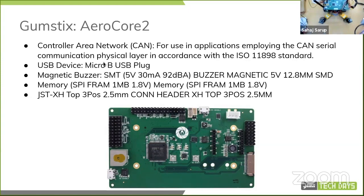Apart from that, the USB plug here says STM console. In its original firmware, which actually runs PX4, a very, very old version of PX4, that's why I decided to get Zephyr on it. But the console port is actually a USB port directly from the SoC, so you can use it as an external storage device or console. I actually have configured it as an external storage device, so you can have your flash storage attached there, and it will work fine.